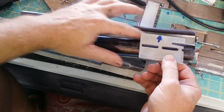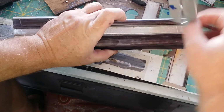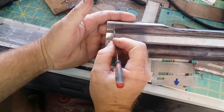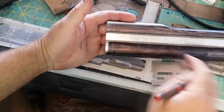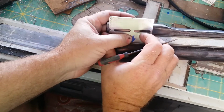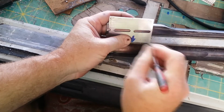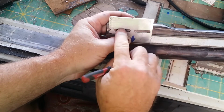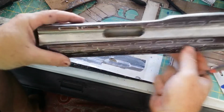This leading edge sits down in the slider, which is for the pump action, which gives me the alignment I need for that first row, and reversing it around the other way gives me the top alignment that I need as well. So you can see where I've scribed in a line there. That's my start line that tells me where I need to work out that first slot. So all I need to do is line that up on the inside to that edge, scribe in a line around there, do the same thing with the next one, and then all I need to do is bring this one to this one. And with a bit of perseverance, I end up with that.